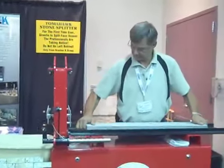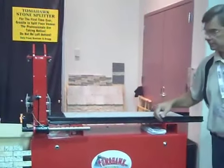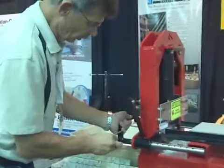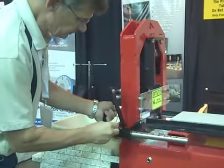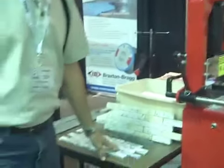Loading the material. Select a piece of material with the appropriate width and no longer than four feet, and place it polished side down between the guide rails. The polished surface of the material has less friction and will therefore slide easier when pushed forward to the stopper to be cut.